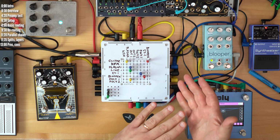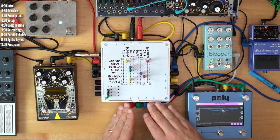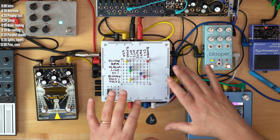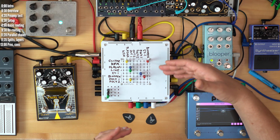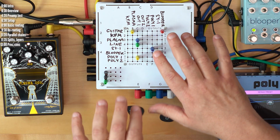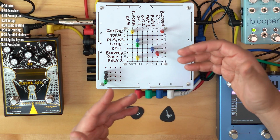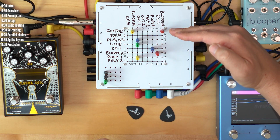Another con compared to some of the other options: other than level control on input 1, if you get the preamp model of MTX8, there's no level control for the inputs, matrix points, or on the outputs. So you'll need to control levels in the audio outputs of the instruments coming into the inputs, or have some sort of input gain control wherever the outputs are going in. I know the pins have different colors, but they're all identical, so there's no option to attenuate the signal differently using different resistance pins like on the EMS Synthi. So once a signal goes in, it's at the same level for any of the outputs that you route it to.